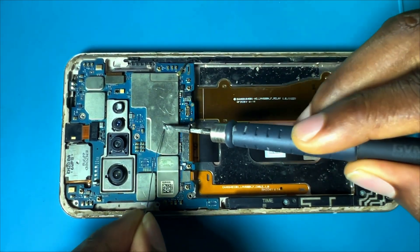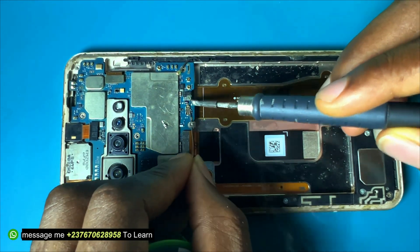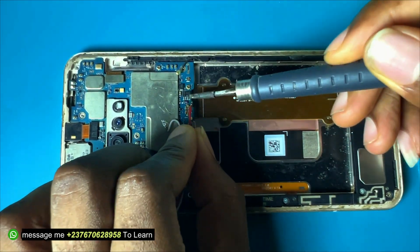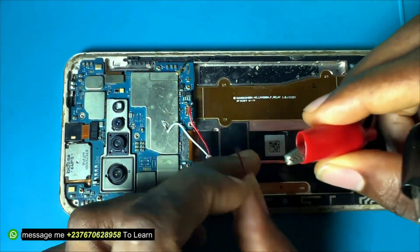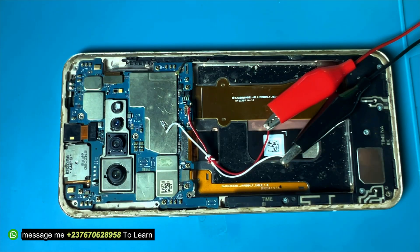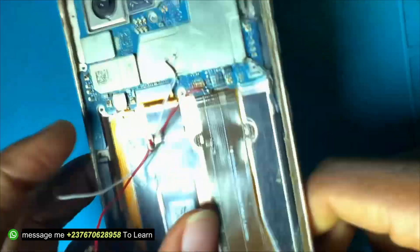I'm not talking about the secondary line, so I had to inject my DC power supply into the mobile phone. I soldered some cables onto the mobile PCB — I connected the GND cable and also the VBAT cable. Then I connected the mobile phone to my DC power supply, switched it on, and felt some heat coming from this section right here.